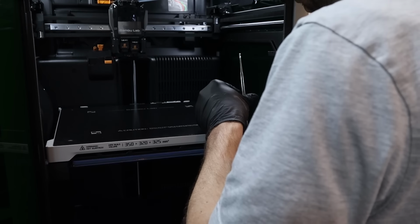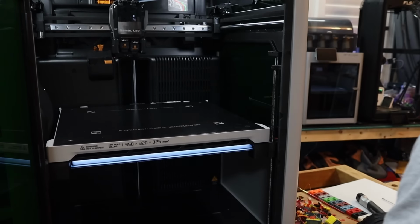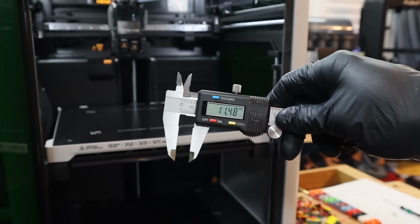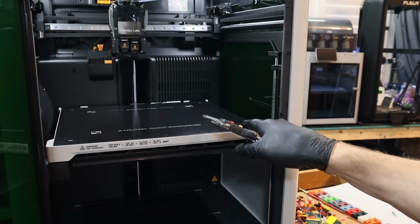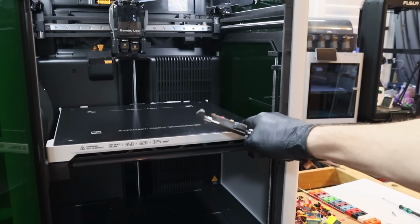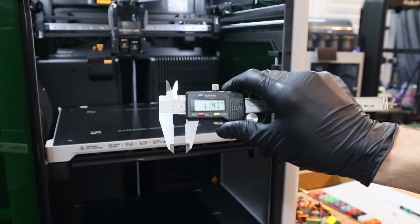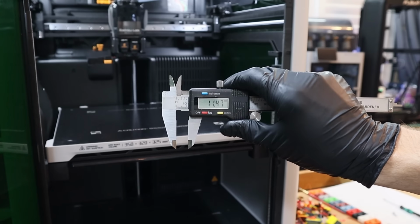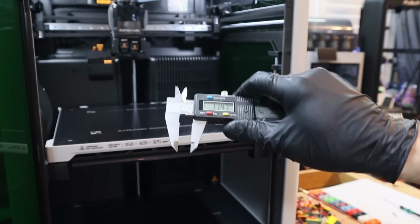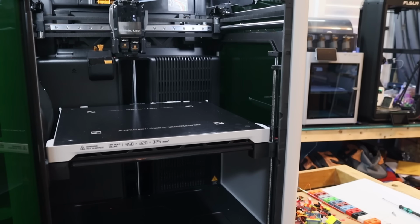So that definitely is thick aluminum, quite a bit thicker looking than 1/4 inch. It looks like 3/8 of an inch to me. I'll grab a measurement. So the total thickness is 11.48 and it's about 2.5 millimeters on the top thickness there before the aluminum. So that brings us to about 9 millimeters for that aluminum thickness. Pretty good. I don't know why it's 9 millimeters. That seems like a strange number, but that's what I'm getting.